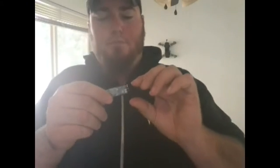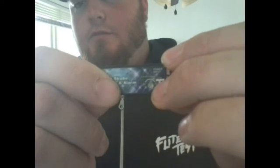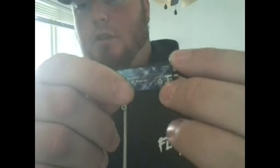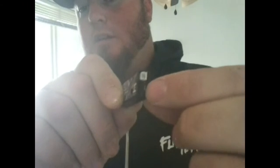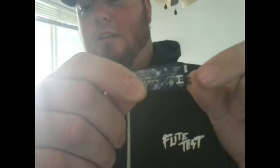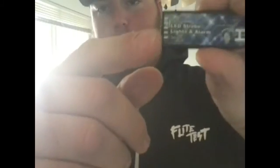Like I said, here's your tuning for your volts per cell for the low battery alarm. You have a power input connector. And then this is your jumper right here so that you can go from 2 to 3 cell. On the output side, your bottom pin right here is actually for the speaker, for the buzzer.